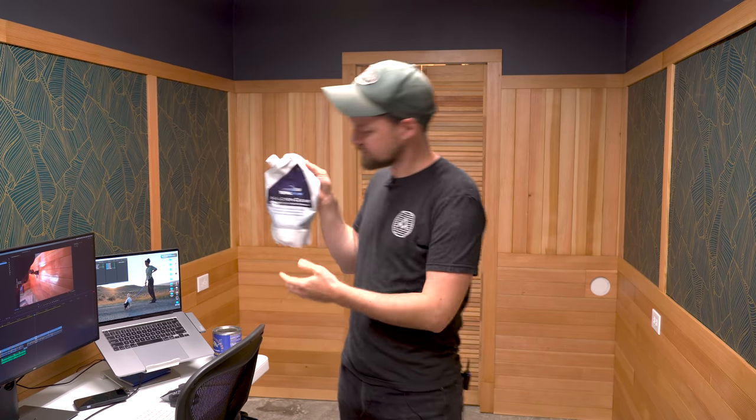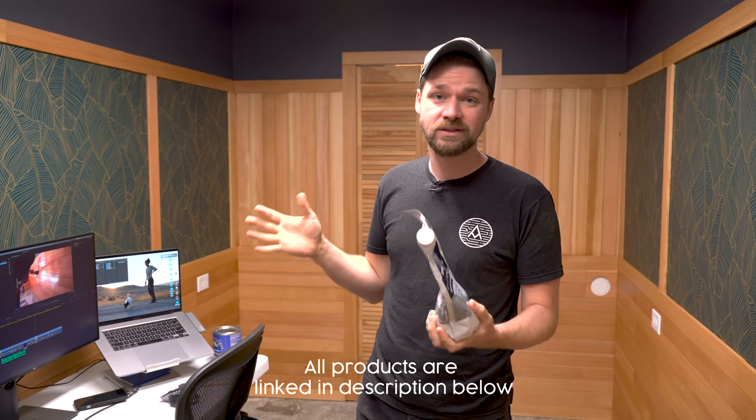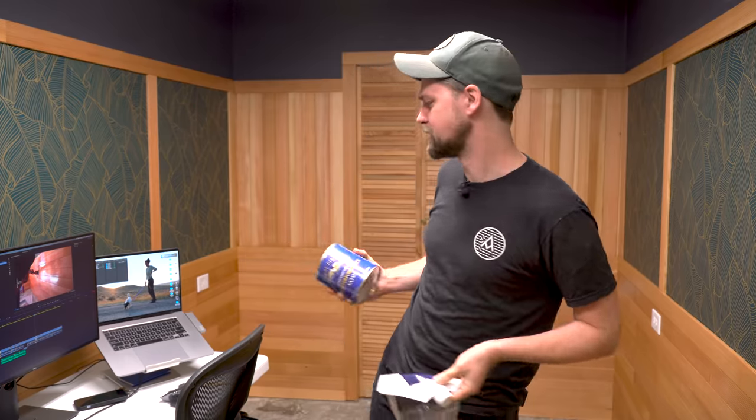I have a discount code for the Total Boat finish — check the link below. But this isn't the only water-based finish and all these processes apply to multiple water-based finishes. This water-based top coat has been my go-to for a long time. There's also polycrylic, which I've had not quite as good experience with, but it's more accessible in box stores. If you don't live in the United States, you may need to look for other water-based finishes — the application process will be the same. Do not overwork the finish, lay it on a little thicker than you feel comfortable, not so thick that it drips, recoat within an hour, and sand it back.